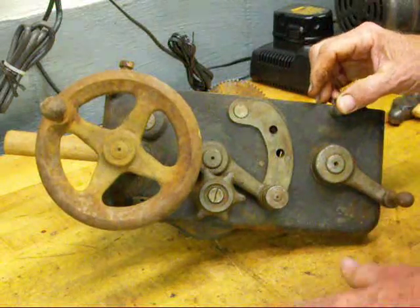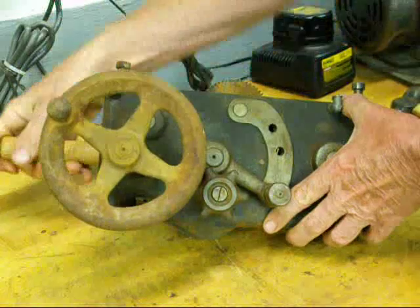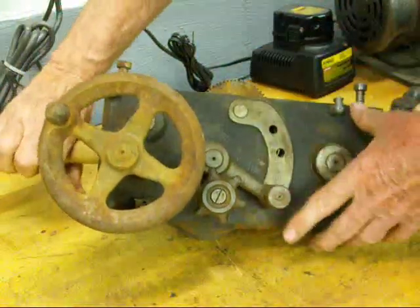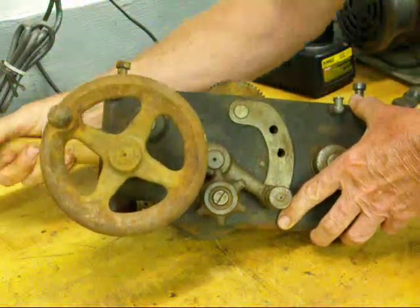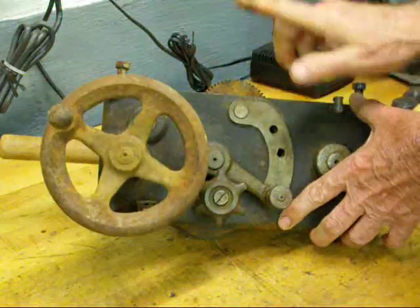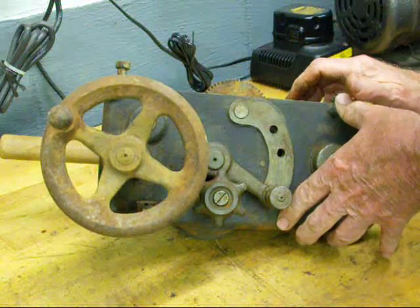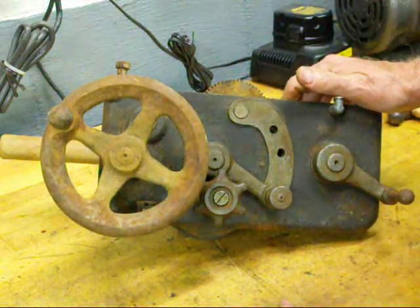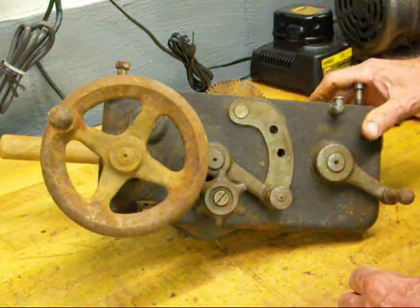Some people do that, but that's not a good practice. As I turn this lead screw, you can see that this gear on the top is slowly moving, and that is transmitting the power from the lead screw through the gears and up into the bottom of the cross slide, moving the cross slide either away from you or toward you — again, depending on how you have your feed reverse lever set.